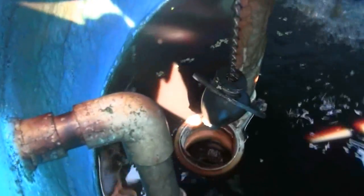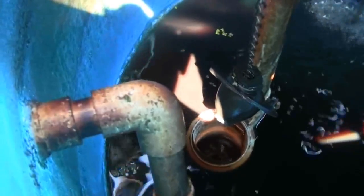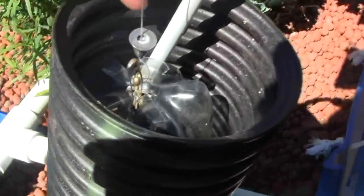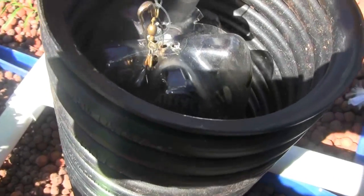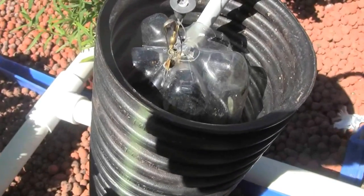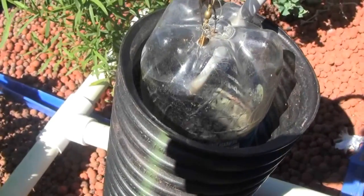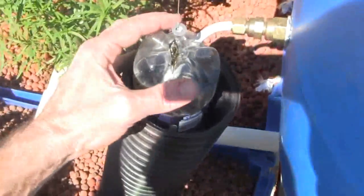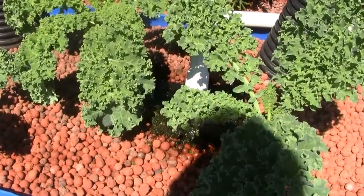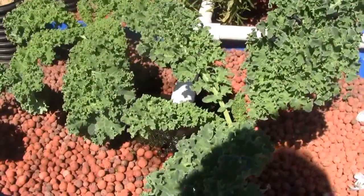The water came across that elbow, came in here, and it's just a hole inside this little plastic bottle on a little fishing line. When the bottle fills up, it drops down, and when it drops down, that opens the flush valve inside the tank — just like that from the weight. Then after the water in the tank has drained out into the aquaponics setup, the bottle comes back up, and off it goes.